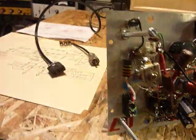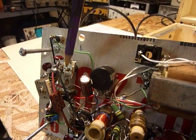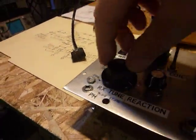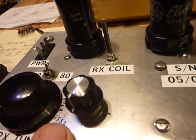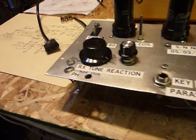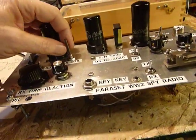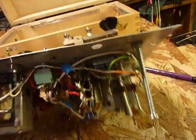This trimmer capacitor right here came out of an old car radio — it had a shaft on it, which goes up to this knob. That makes my tuning, and you can see right there where I marked 3552 — that's where I was using it. It works really nicely and spreads the tuning out like a band spread. You can mark right on there with a small Sharpie permanent marker. Here's the tuning for the receiver — the slug tuning; I tuned it up on 40 meters.